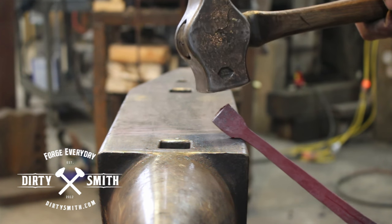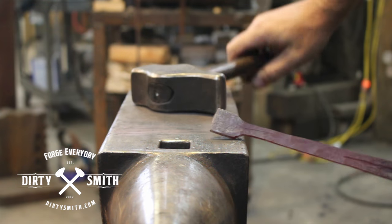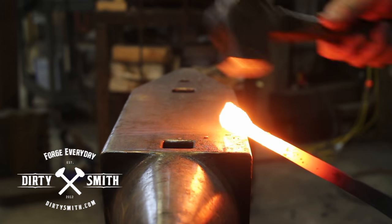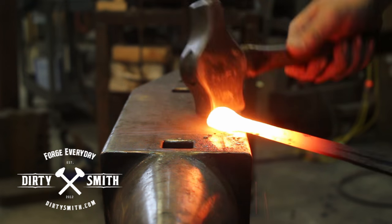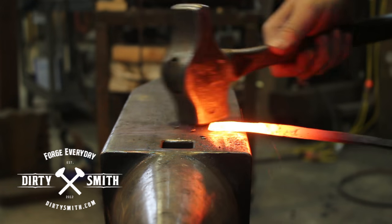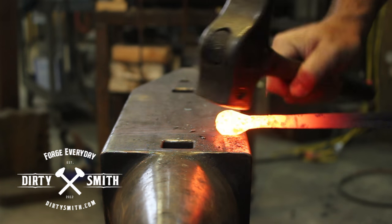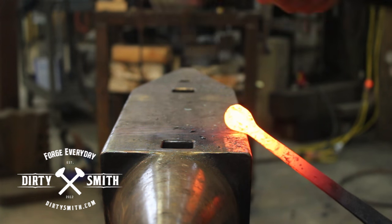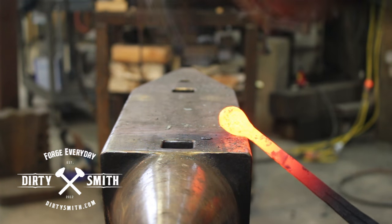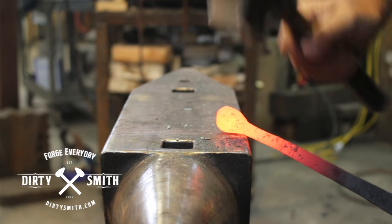This next part we're going to make this guy round — come on the edge here and box those corners in, see if we can make this an interesting shape. Basically you're knocking those corners down and then from there making it roundish — kind of similar to the snub end like we just did with the hinge. Seems like if you can do a snub end scroll, you get pretty far just with that exercise. Practice snub end scrolls — they're attractive, very appealing, everybody loves them.